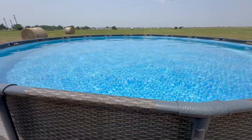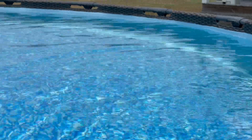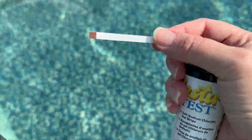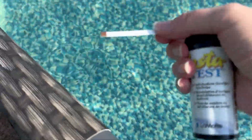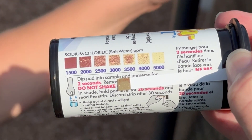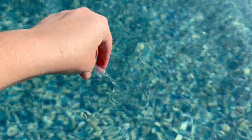After adding the muriatic acid to bring the pH level down, we let it circulate through the filter. The other things I test the water for are the salt level—to keep that within range so there's enough salt for the chlorine to generate but not too much—free chlorine amounts, and lastly phosphates, which were a little more tricky to read with the test kit.